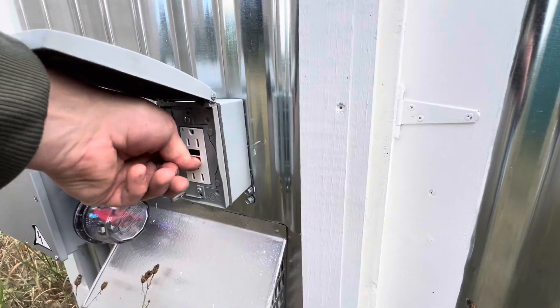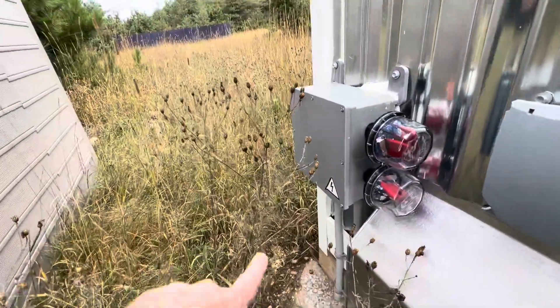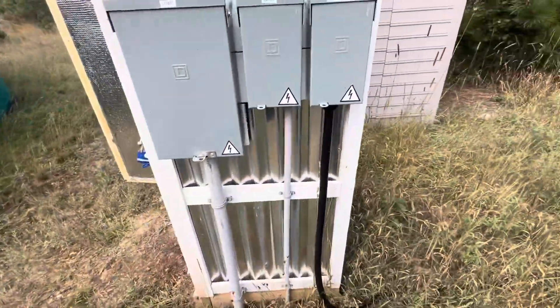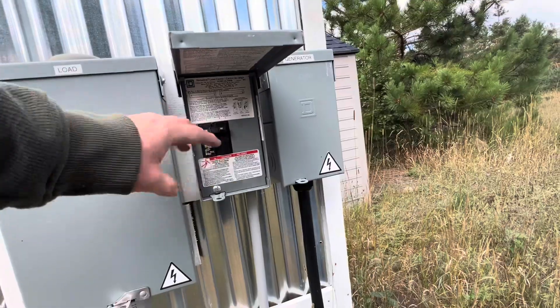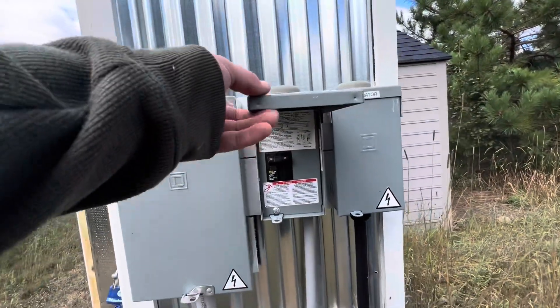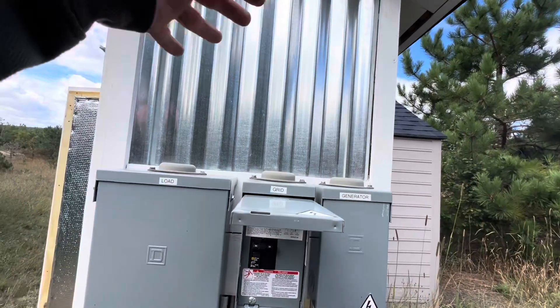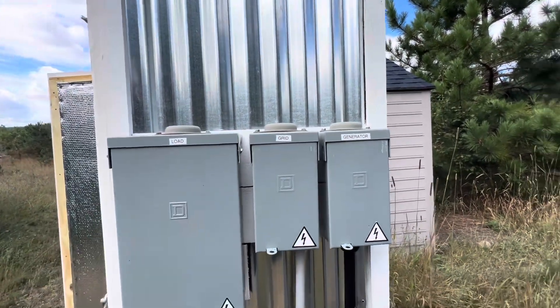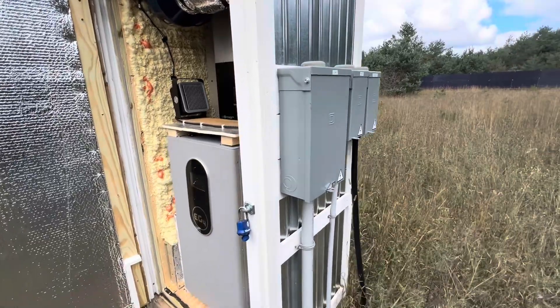I think this GFI, of all things, is not working — I'll get him a new GFI. There's a splice box, you can see the pipes — the strings go all the way out to the solar array. Sandy soil here required a lot of grounding, so there's actually four ground rods in a line about 10 feet apart. The grid connection here — for any electricians that want to know — I'm not using this; it's a placeholder, maybe for a secondary inverter or generator. I brought the ground wire into this part and did the bond here. I chose to treat this thing as if the grid was there and put the electrical bond right there.